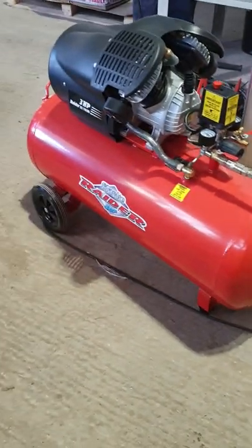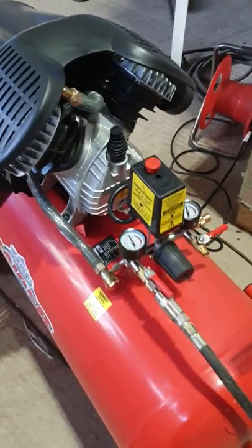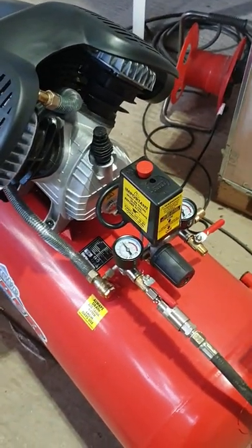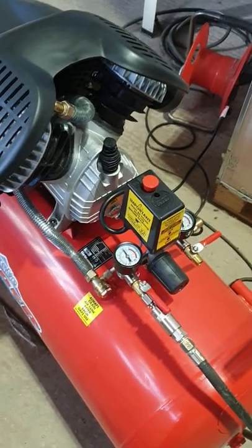So if you're thinking of blasting with a little 50 litre — or I've had people asking about 25 litre compressors — it's just not doable. I think that should cover it. 100 litre compressor is the bare minimum. 18 CFM is recommended.